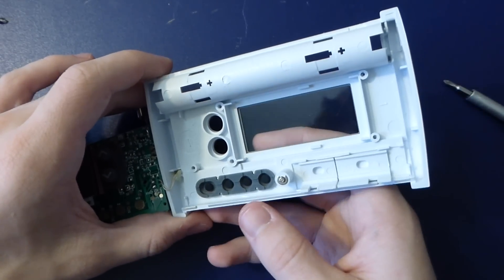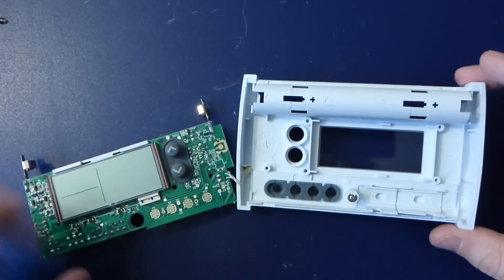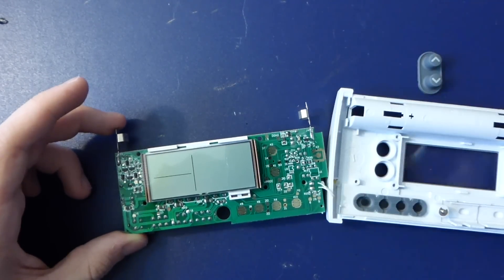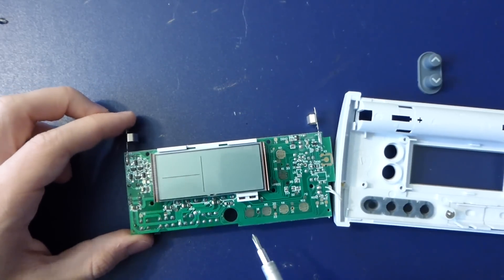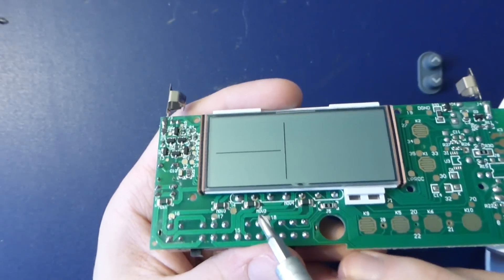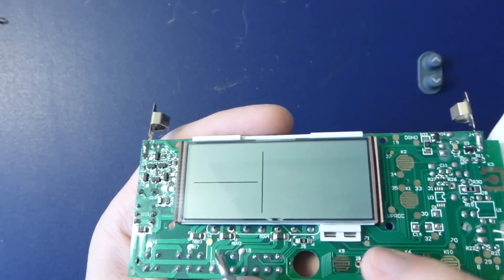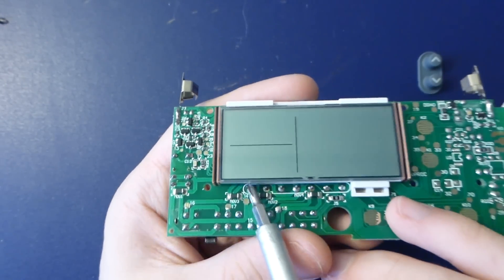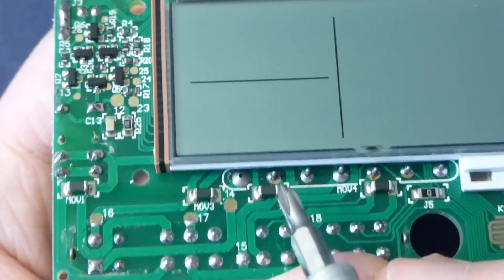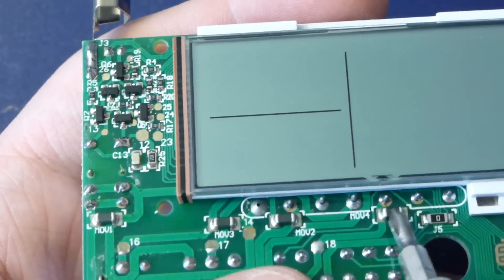On the inside here we've just got the switches and some simple membrane buttons. Then we've got the board with more buttons over the contacts. These are the pins on the back — they come up right here under the display. And this pin, the one that's missing, has pulled clean out. There's a hole right there where it's completely gone, and the one next to it doesn't look like it's got any solder at all — barely there. These two also have barely any solder.